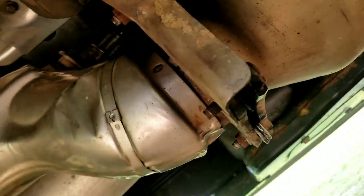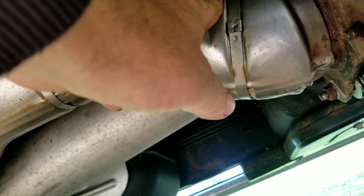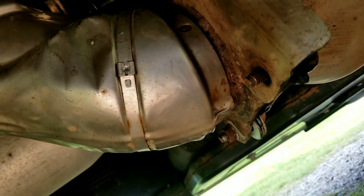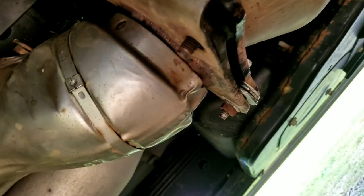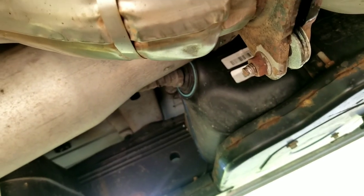This really isn't a tutorial on removing the exhaust, but I'm going to cover it all anyway. I've previously had this off just to take a look at it and see how the truck ran without it - yeah, you can start the truck without it. I pulled these 16mm nuts off. I was able to use the impact for three of them - soaked them with WD-40 and got them off. The fourth one, which is the top one on the inside, I was not able to get with the impact. So I took my 4-inch grinder and ground half of that nut away, which then released it, and I was able to loosen it with a chisel and unscrew it.